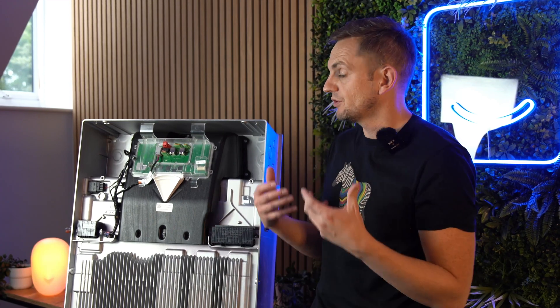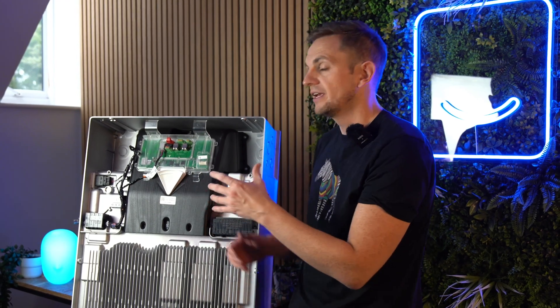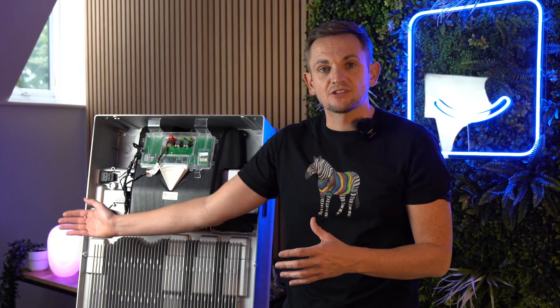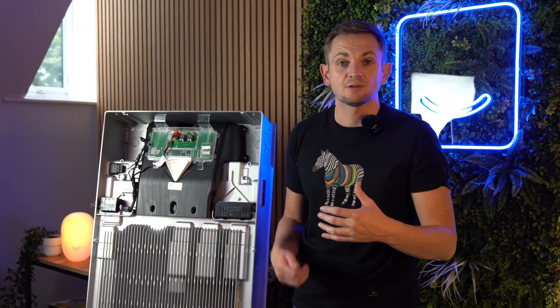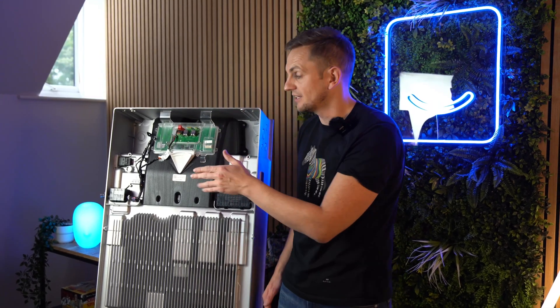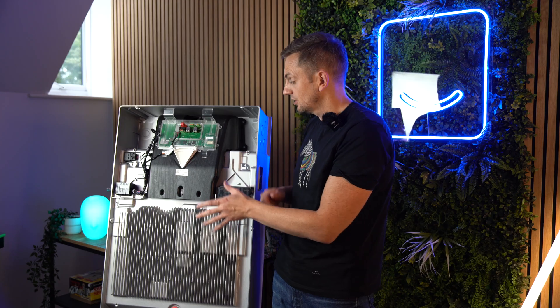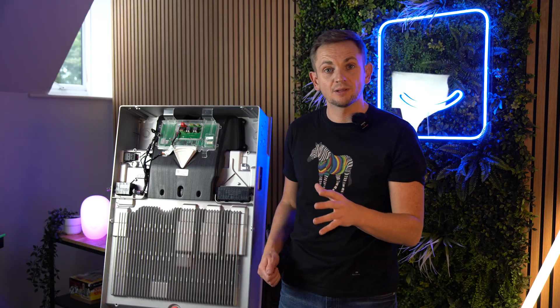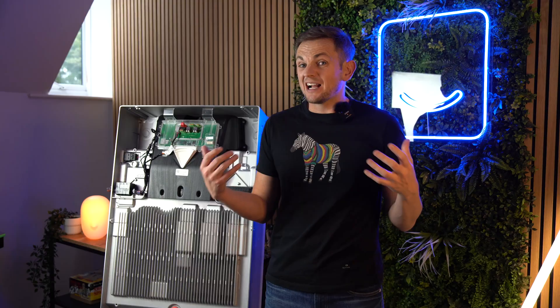What if you don't have solar and just want to charge up on a cheap tariff? You can still do that — you AC couple it, connecting to the grid on the left-hand side. The inverter converts it to DC for storage, and when you need it, it's pulled from the DC cells, converted back to AC, and sent to your fuse board. So the main difference is: DC-coupled solar panels wire in on the right, AC-coupled on the left — and you could actually do both.